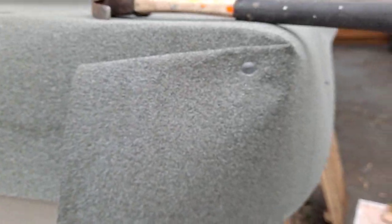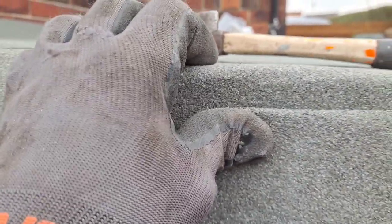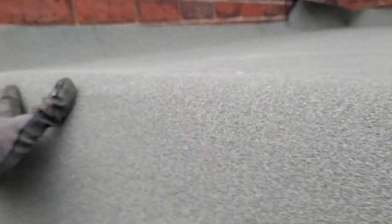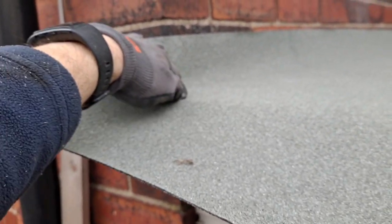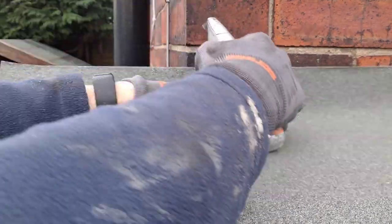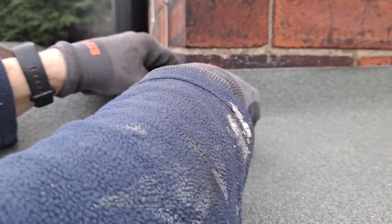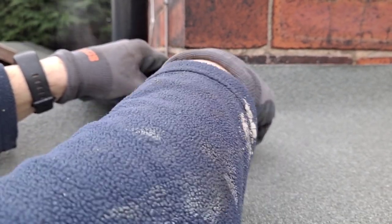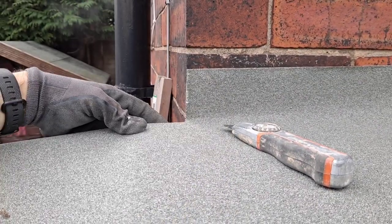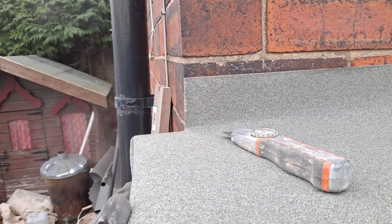You can put another one there if you wish, but all these down here will need tacking in. Because this is going up against the wall, we need to trim this off as well. To trim it up against the wall, it needs to be flat against there, then you just need to cut down here and take that back around and bring this back across like that, and you make another corner similar to the front.